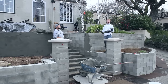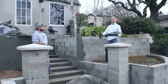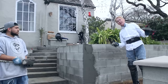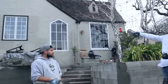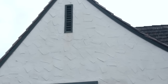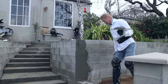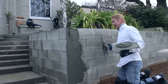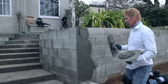Howdy folks, Kirk and Jay here with Kirk Giordano Plastering. Today we're going to show you how to do an unusual texture — we'll show you the cements we use and how to do it, where to buy it. That pattern right there is an old-world finish, meaning it was done when they had real craftsmanship. Today everybody wants a three-coat system — scratch, brown, and a color coat. We'll show you how we match that with a square trowel.